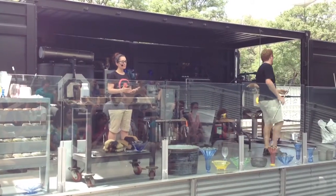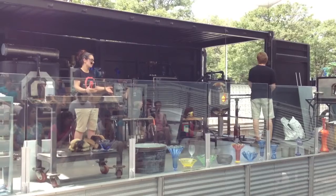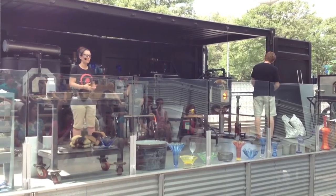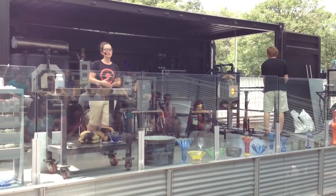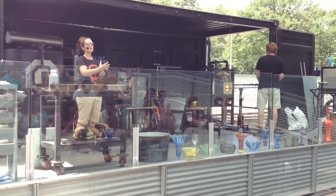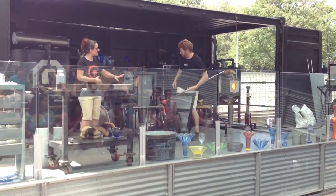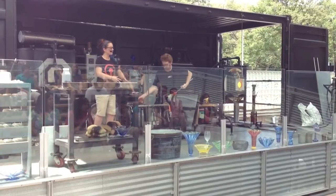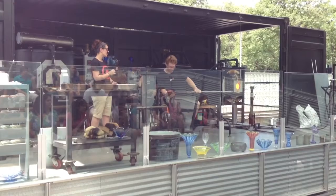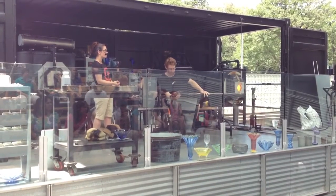Now, as soon as the temperature's even, we can begin to inflate the glass and get a nice even expansion. Sometimes you can move right along into that with just the heat from the melting furnace, but a lot of artists will go back for just a few seconds in that reheating chamber to really make sure that heat is nice and even. If we have an uneven temperature in our bubble here, we're going to get uneven expansion. The breath of air that you blow into the pipe is always going to take the path of least resistance, which is the hottest and therefore softest glass.